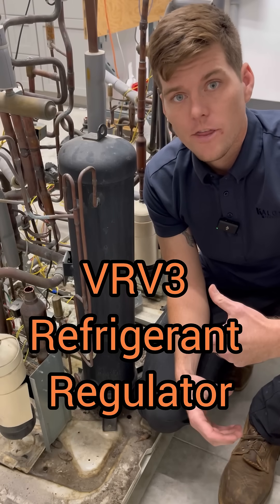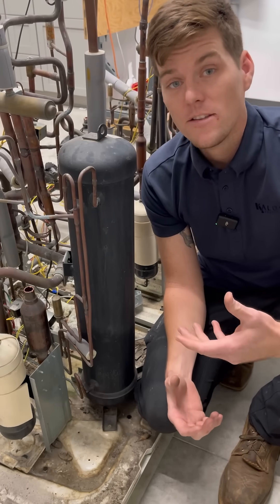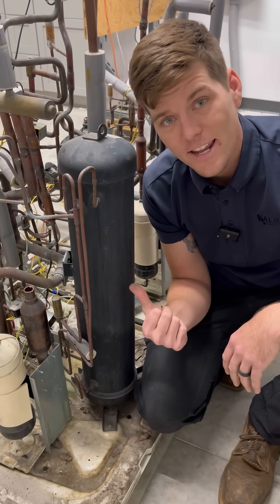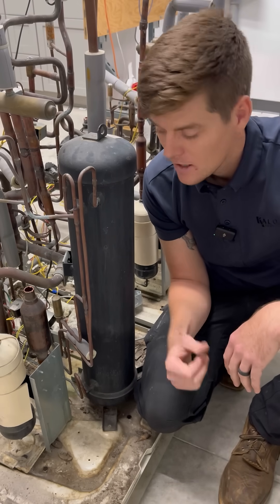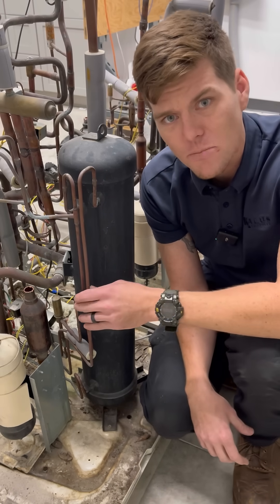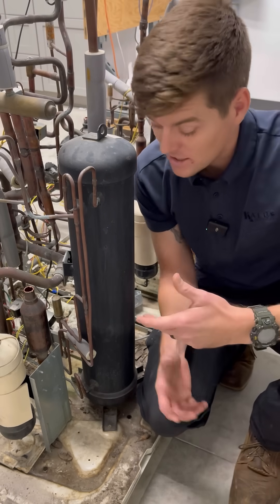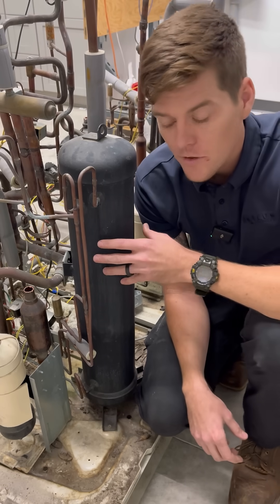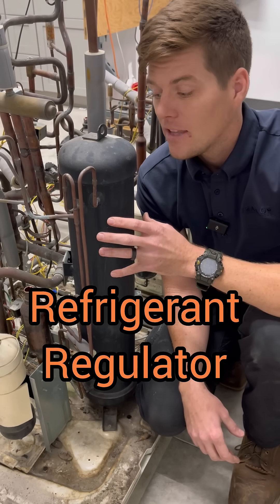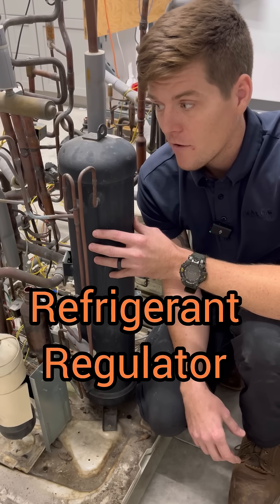If you're like me and you've worked on a lot of VRV3 but you've never really talked to anybody to ask what the heck this giant cylinder is on the right hand side of most VRV3 equipment — you see this giant tank is not actually an accumulator. You'll notice a lot of these small lines attached to it, and obviously the heat exchanger has been removed so we can actually see it close up. This is what they would call a liquid receiver, or even a liquid refrigerant storage tank, for VRV3.